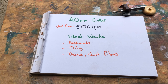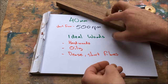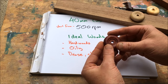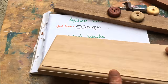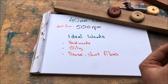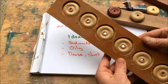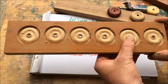The best woods are hardwoods that are oily and dense. I've found spotted gum gives me the nicest finish on the wheels — they come out really good without any need for sanding. Jarrah works out nicely too; it's fairly dense and makes small chips with fibers that work well. An example of a bad material is black butt timber — good for many other purposes but it has really long stringy fibers, making it easy for the cutter to bite in and chew it up. Another bad example is some recycled cedar: it's aged, has a lot of elasticity and very stringy fibers, and I've had a really hard time finding a good speed setting for it.